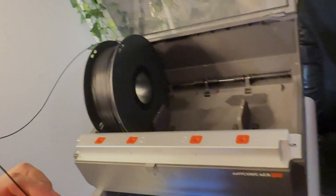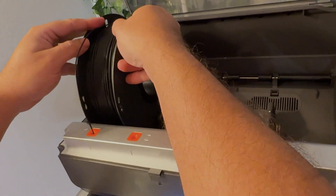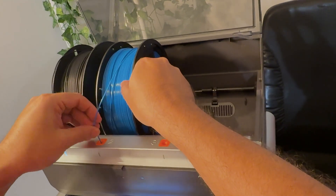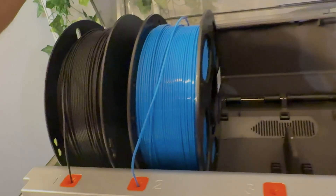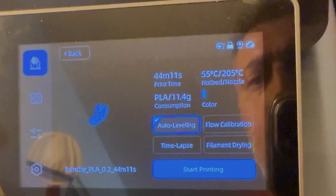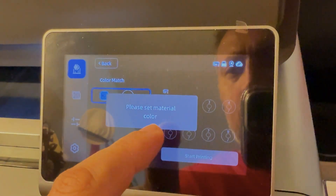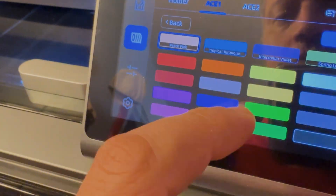Let's print one of the models from the included USB drive and run our first test. I want to test not only the printer but also the AMS module, so I insert two filaments into the AMS module. The black one is Creality PLA filament and the blue one is Anycubic PETG filament. I insert both into the AMS module, trim and straighten the ends, insert them into the corresponding slot and push them in slightly. The light starts flashing once the filament is inserted. I go to the printer screen and click start, then select the bench model from the USB drive. At this point I realize I need to configure the filament settings in the AMS module first — by selecting the slot number and choosing the material type and color, the AMS setup is done.